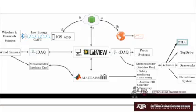An independent algorithm will analyze real-time vibration data to detect and mitigate major bit dysfunctions. Redundancy is achieved by using several control loops within our system architecture, with different loop times varying from 1 Hz to 20,000 Hz. Additionally, an algorithm will be implemented to calculate trajectory using real-time data and historical inclination data to ensure that we are drilling towards our target zone.